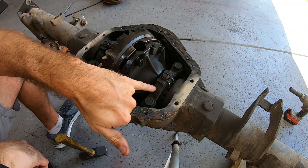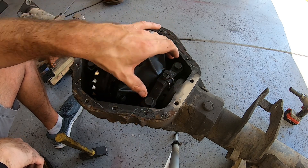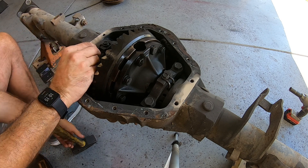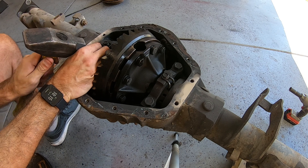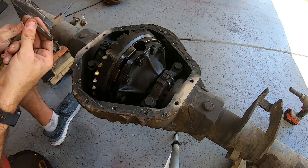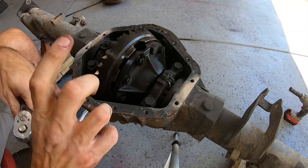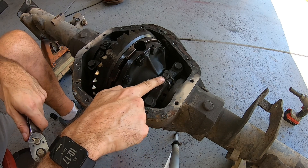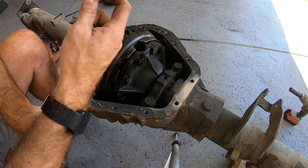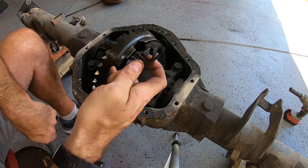We now have our letter A stamped on both pieces — they match each other, so we know which side lines up in which direction. On the other side we'll turn the symbol sideways pointing in the same direction to differentiate it. Once stamped and marked, remove the barrel adjusters and put them off to the side. These can be interchangeable — one side can go to the other, no big deal. The bearing caps are really the only things you have to be conscious of, and now that we've stamped them, it's no big deal.